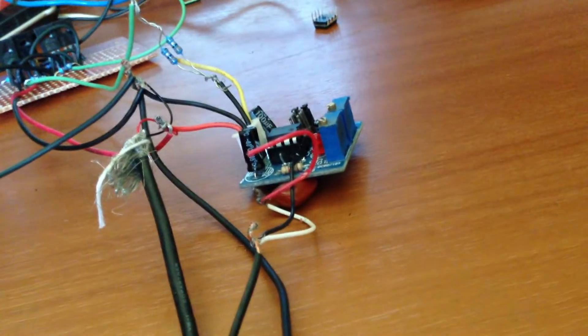Not a very big output, but it's only running from one MOSFET at 12V, so the output kind of sucks. Assuming these 555s do a full-wave sort of output, I'll probably try and make some sort of half-bridge connected to it — but that MOSFET's dead.